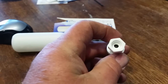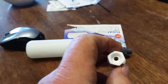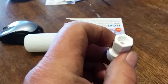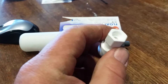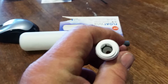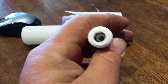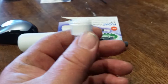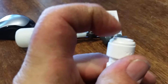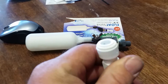That's another thing — went to the big box store, they have a whole bunch of these things sitting around with this end, but nobody has heard of a faucet fitting. That's what they're actually called: a seven-sixteenths faucet fitting. It's kind of like a SharkBite-style connection. You can release it by pushing down on this collar and it will release the tubing. Really slick.